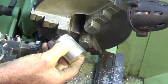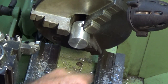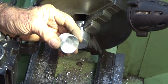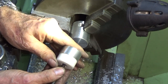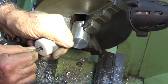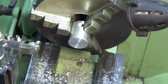Now we can get on and make the aluminium part — basically the body of the pressure gauge. I know what you're saying: hang on, that was longer before when you showed us, and where did all this aluminium scrap come from on the lathe? Well, I'm not stupid — I've already made one. I wanted to be sure I had the process right before I showed you. I've also made a Delrin plug that goes inside it so I can turn it round and machine the back to get this surface really smooth and clean, and also do that radius on the edge. It's a really snug fit. I've threaded it so I can get that plug in and out fairly easily. Alrighty, let's do this one now that I know the process.